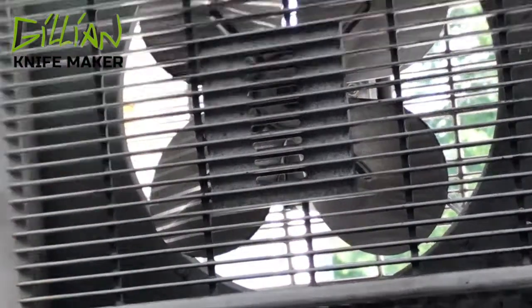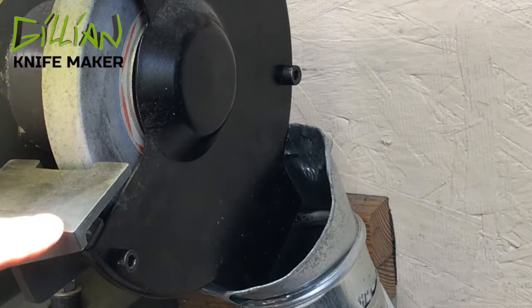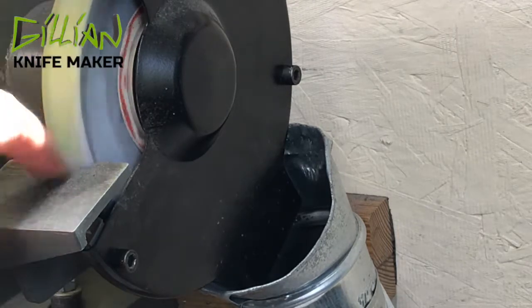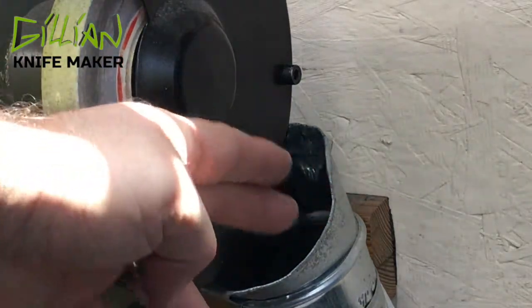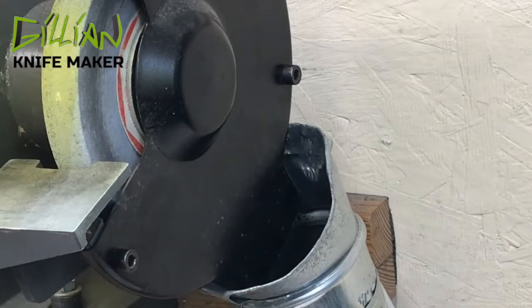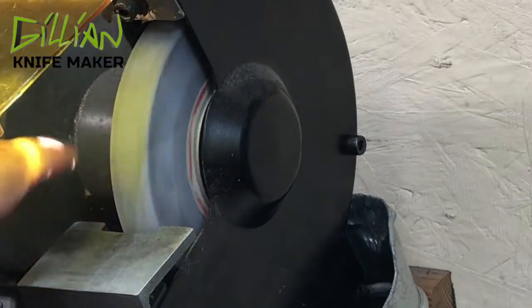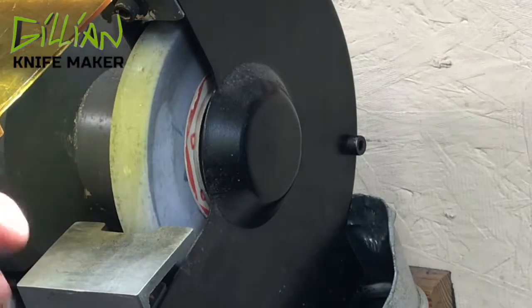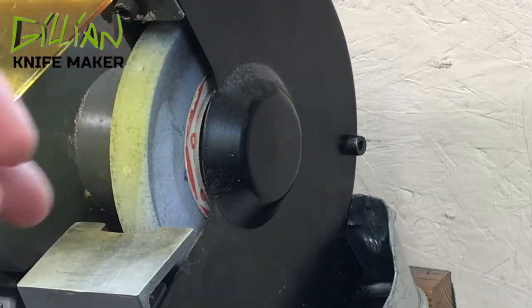You can see I have a little ventilator in the window and this here is my bench grinder, running at 3600 RPM. It's just a normal bench grinder and I have a soft stone on here — this is what I'm going to use to shorten the screws with. I do have duct work, and there's a big blower underneath the floor to help pull all these particulates out of the room. These very soft stones make some really bad particulates — it's extremely small, almost like a gas.